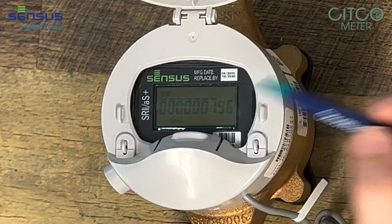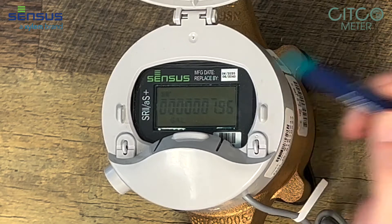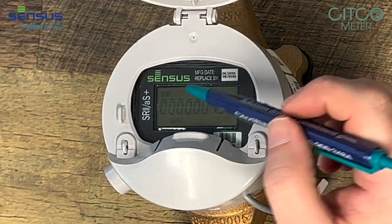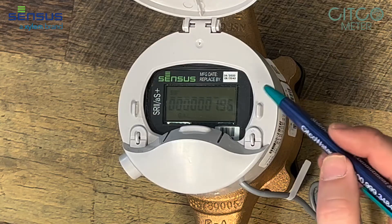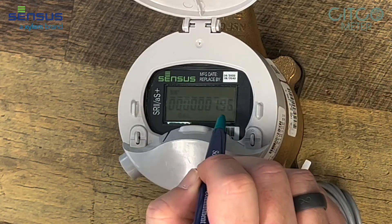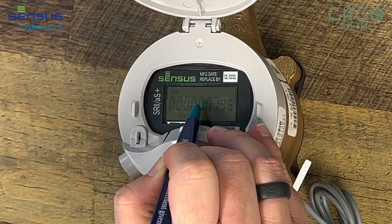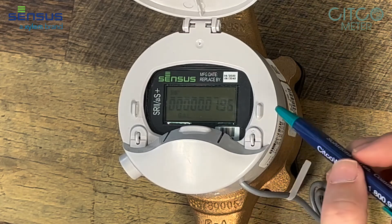It's got the entire dashes there, and there's a decimal point right there, so this meter reads down to the hundredth of a gallon. These black dashes on the top are what it puts out when it's reading AMR. This meter is set up to read in one gallon — the black dashes are on every dash except the last two, so it gets to one gallon. If you were reading in one hundred gallon, you'd only have dashes over the first five numbers. Ten gallon would be six digits. Wherever the dashes are on the digit is what the AMR system is putting out.